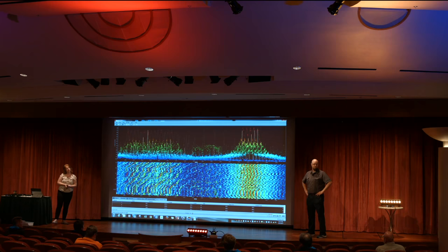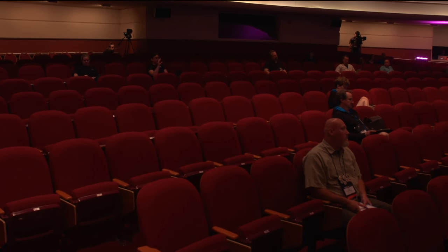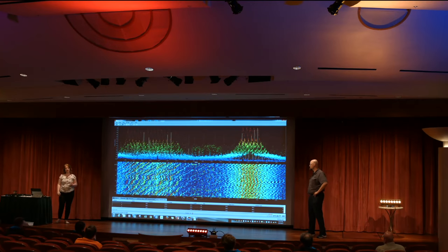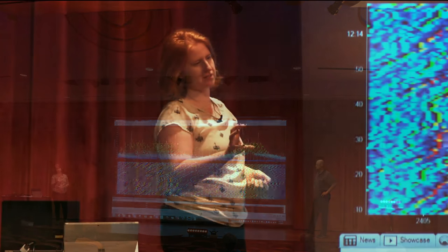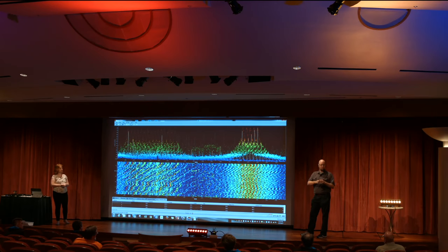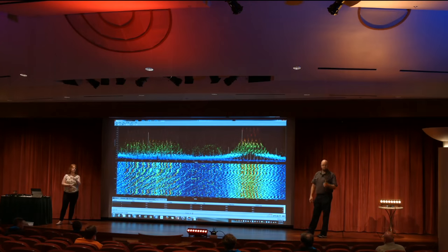Yeah. And then my second quick question about that was because the context you were talking about the adaptive frequency hopping was with the full spectrum wireless ID. Does it only do it on that, or will it do it on any? So there's only one wireless ID on the front of the device that you get to have that. So the green one is the only one that does the adaptive frequency hopping, but it covers the same 1 through 11 as the full. Right. So it's covering the same channel range, but one is doing it with the adaptive frequency hopping and one is not. Yeah. I just wanted to clarify that that's the only.